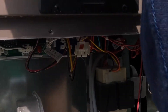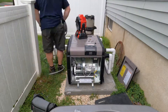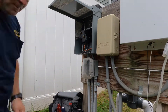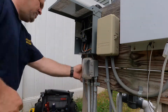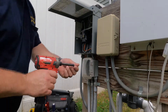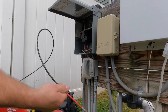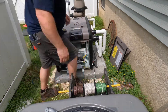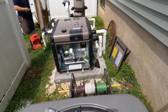I changed that module around — it comes shipped as a 240 volt connection and I wanted to run it for 120 volts. Here I'm running some half-inch non-metallic sealed conduit, then I'll connect it inside the panel. I'll shoot my nylon fish tape through the conduit and pull number 12 American wire gauge conductors, then wire up the pool heater before connecting it to a GFCI circuit breaker. This work didn't take that long — I was there maybe two and three quarters hours — and I'm waiting for the gas guy to hook up the gas to make sure the heater is working.